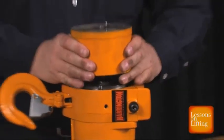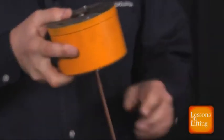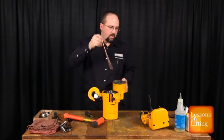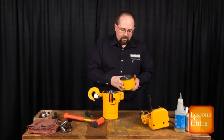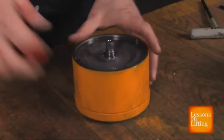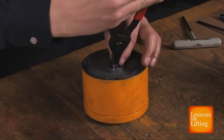With the air motor loose, we're going to lift it straight up. The brake tube runs through the center of the air motor and it is imperative that we don't bend the brake tube. Take the brake tube and place it safely out of the way. Flip the air motor over and we're ready to start air motor disassembly. To start, we have to remove this snap ring that retains the front plate to the rotor.